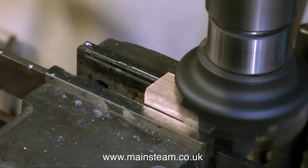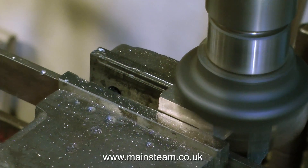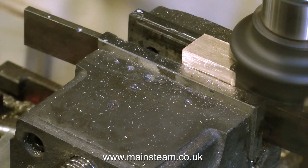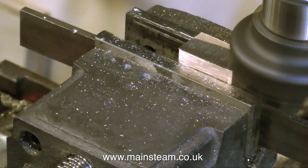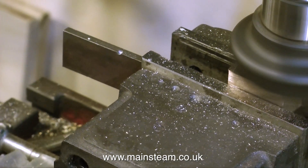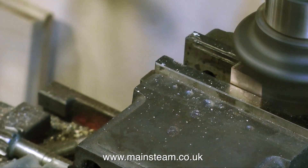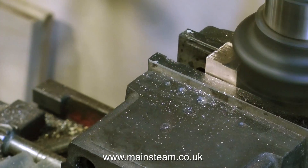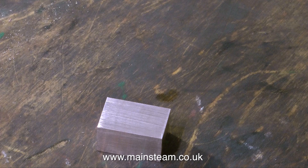If you're taking a shallow cut, you can traverse a little quicker. But please, not as quick as this — this video is speeded up just because the process is very slow. The speed that you can go at is really governed by the strength of the milling machine, but do be careful. If you break a tool — not a facing cutter like this, but an ordinary milling tool — it can be really bad. I once did that: the milling cutter snapped, and it whistled past my ear and embedded itself in the concrete wall of my workshop. No such events this time.